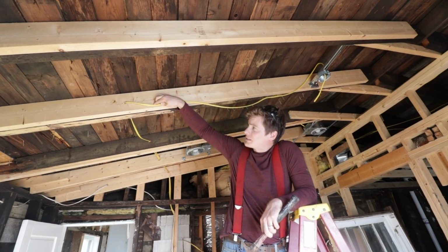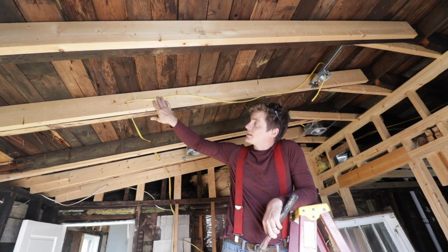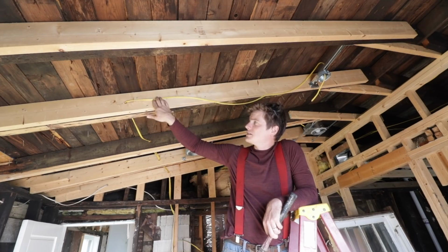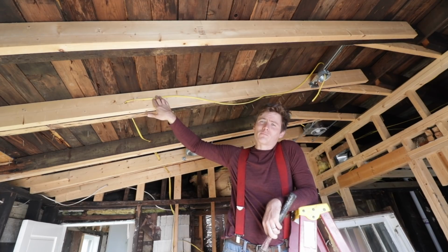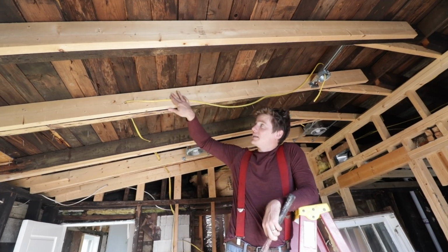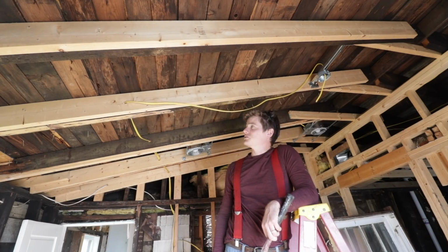Reason, because when the drywallers come in and they miss something, they can put a screw right into it. It goes up here in the middle. You don't stick it way up here either, because if it's ever a re-roof job done in the future, you can send a nail right into it. So stick it right in the middle. This applies for pretty much anything, but then you have to use common sense. If you're doing something a little outside of the norm and you need to shift it one way or another, you got to kind of take that into account.